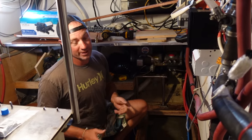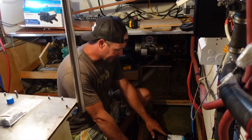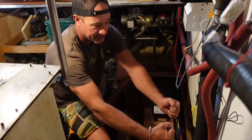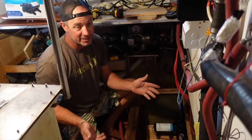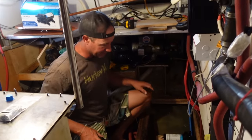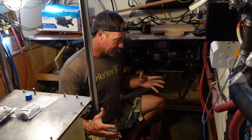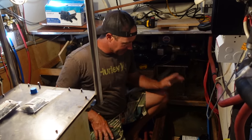We're going to put the right fitting in, new lines, clean the tanks out. We're using mains water and I don't really like that because if something was to burst, then we've got a problem. I'm installing a new water pump — I think it's like 20 or 18.9 liters per minute, five gallons per minute. It's got a strainer, comes down to two valves which I put down low so both tanks will self-level. I've also put a large accumulator which stops the pump cycling so much — without one, your pump is on-off on-off and you put a lot of premature wear on it.